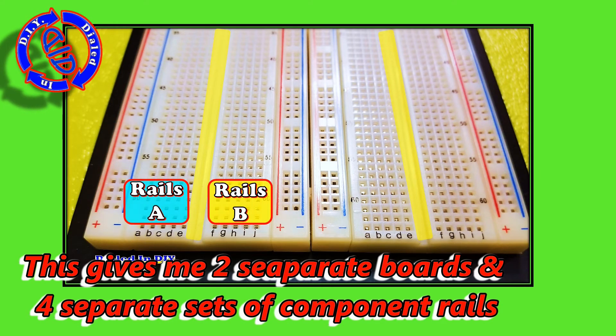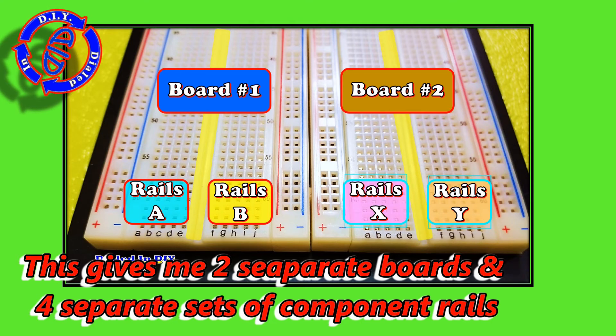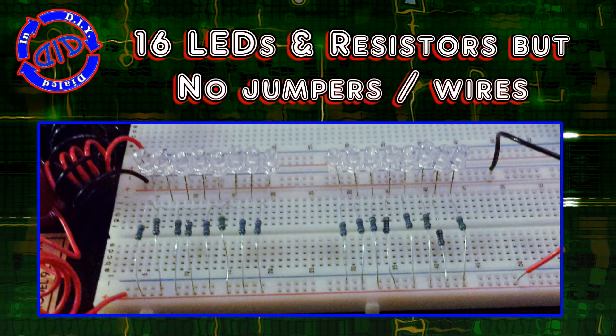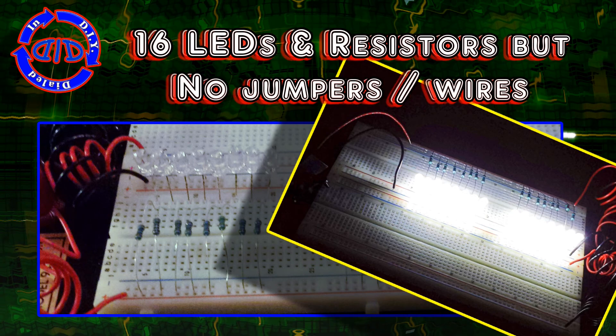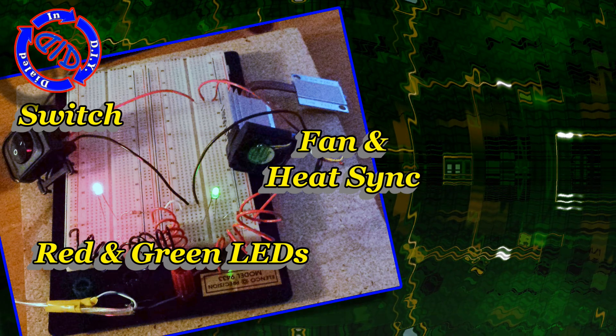You can easily plug it into nodes that are not connected to each other. The layout of my breadboard gives me the equivalent of two breadboards — rails A and B that aren't connected to each other, rails X and Y that aren't connected to each other, and board 1 and board 2 aren't connected to each other either. I particularly like this when I have a project that requires two different power sources that I like to keep isolated. I also like the flexibility the breadboard gives me to experiment with parts, such as this heat sink and fan that I pulled out of a laptop.